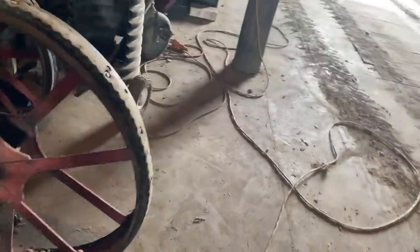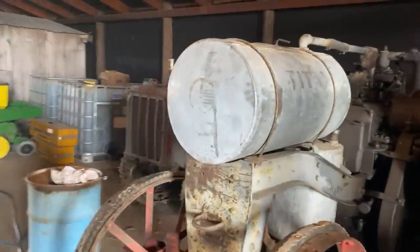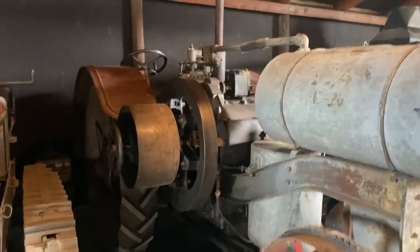This is a 1020 Titan. If you want to find out what year your tractor is — I'll put a chart in the comment section — you look right back in there and there's your serial number stamped into the side of the block. This one is TY63488. Your later Titans have a TY prefix and the earlier ones have a TV prefix. You can look up online just 'Titan 1020 serial number location.' If you have a nice original one, it'll also be back here on the frame rail, stenciled in your serial number. This tractor doesn't really have that on it anymore, not that I can see.